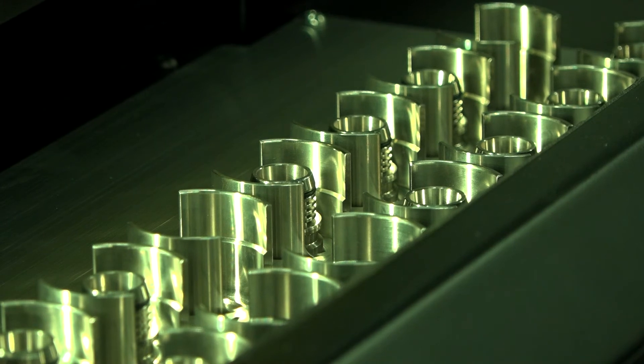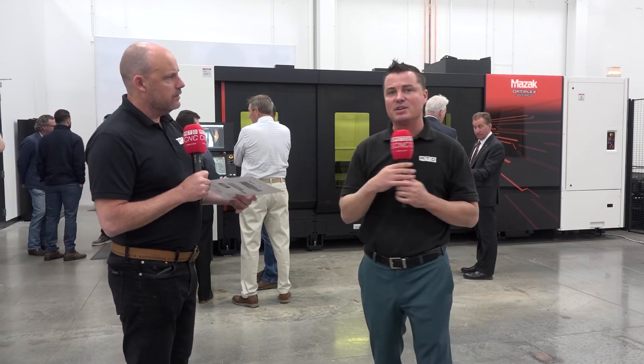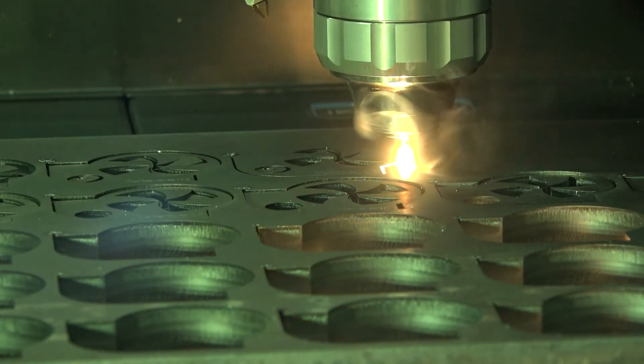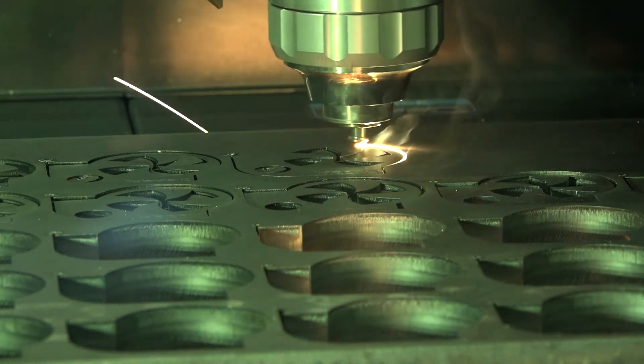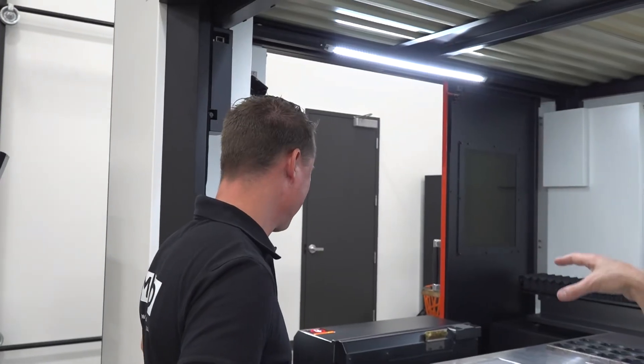There's also a variety of nozzles housed in here, and you change those in accordance with what you're trying to cut. Exactly — to make this understandable, when I think of a tool change with an end mill, imagine that with nozzles, which allows you to switch from material to material and to different diameters. That's one of those things I didn't truly realize until I got here, and Al — standing right behind us — is such a great teacher that I was able to grasp this information quickly and convey it to a global audience.